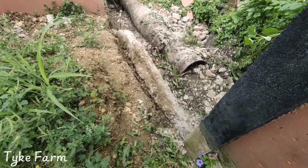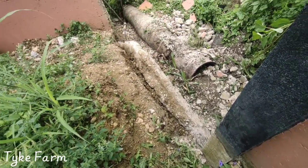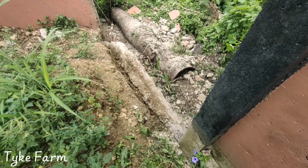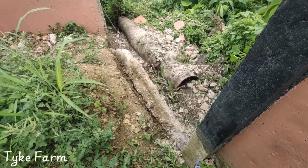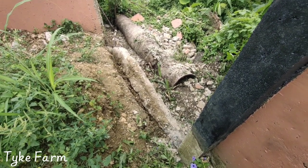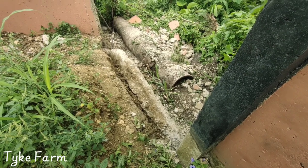It's got the old panel just about out. There's still more there to break up and get out. And then he will be removing the posts from this second panel. But we must make sure we've got some drainage holes in these 2 bottom panels to get the water away.